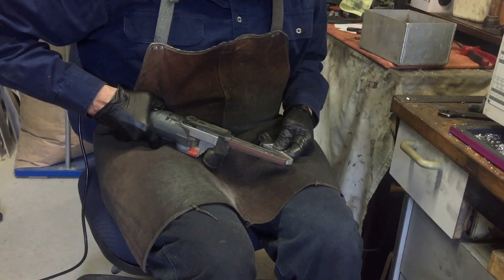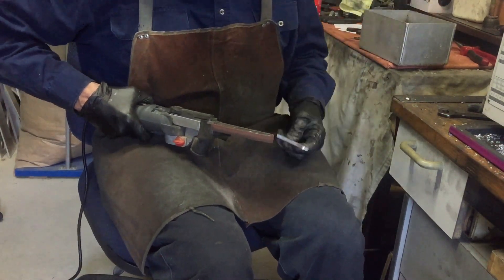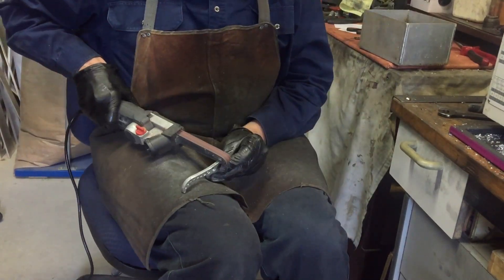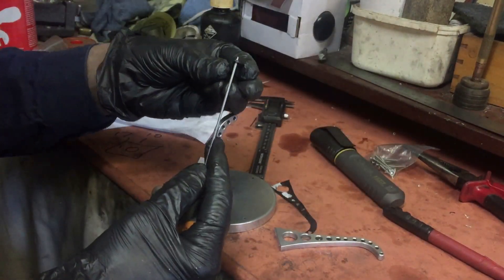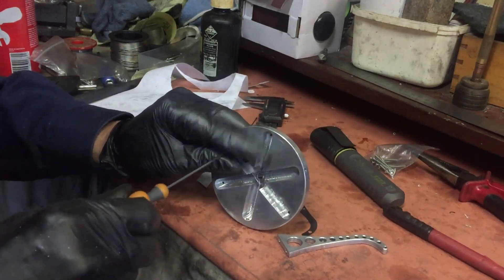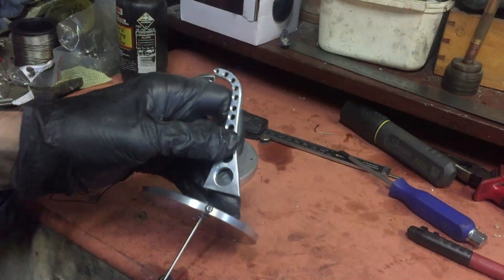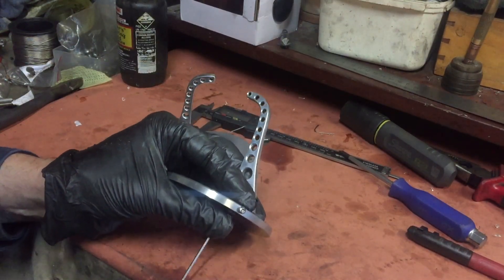With the pieces cut out, I'm just finishing it off with the finger sander. I'll use a little bit of sandpaper on the edges just to make it looking a bit more pretty. Aluminium conducts heat very quickly so I'm having to dunk it back in the water fairly often. I can now put the arms on the base and on the top. If you've watched any of my other videos, you'll know that I make at least one mistake in every build, and this build is no exception — so let me know in the comments what the mistake was.